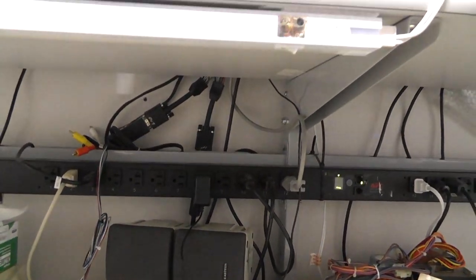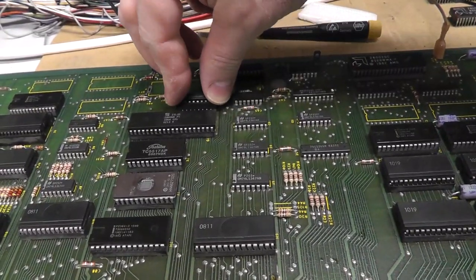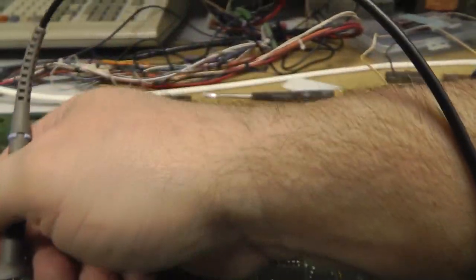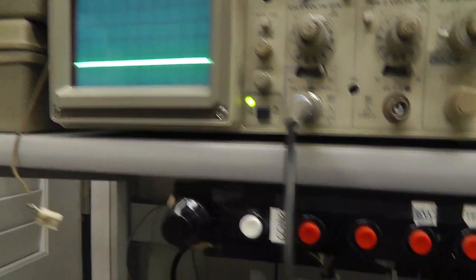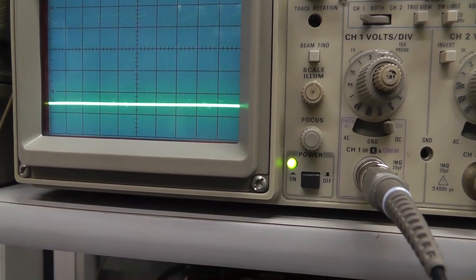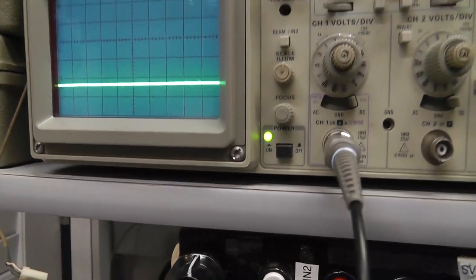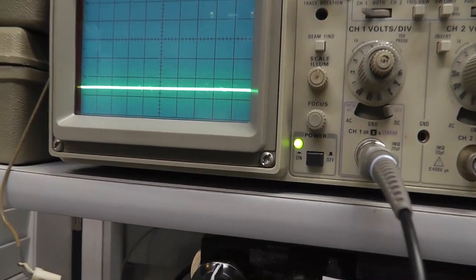I have it in correctly, but nothing — no ROM 6 error, nothing. Let me see — just zeros. Checking the reset: reset is high. Pin 12 has activity. When I did signature analysis on this chip, I knew one of the pins was wrong. I think it was either pin 10 or 13 — it wasn't reporting low. This thing doesn't look great.